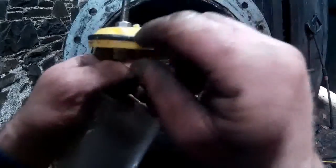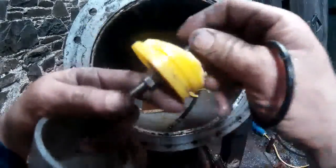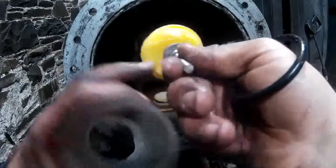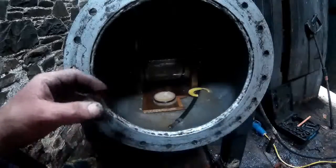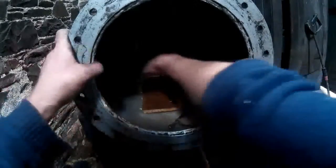There's no striation in the plastic either. Pretty uniform. It's just failed because the plastic's just not strong enough beyond 200 meters, and obviously this bolt through the end cap didn't appear to leak. I'll check the video. It didn't seem to leak until it failed properly. Keep end caps good.